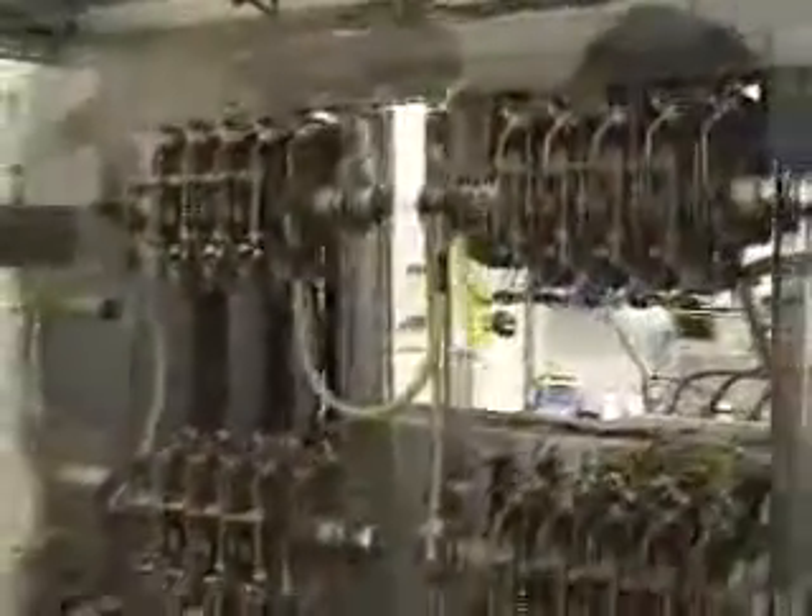You just have to be real careful with this because you don't want to get it wrong. The bridge rectifier — when we get transmitters in or in the field, we just like to make sure visually everything's okay. If you want to tap for a smaller voltage, you could easily tap with this connector here. Right now we're tapped for roughly 10,000 volts.